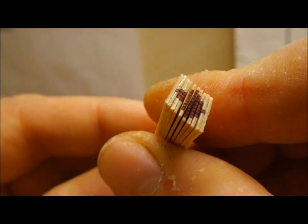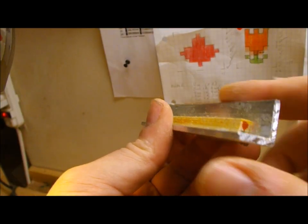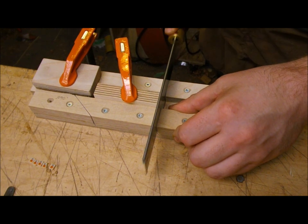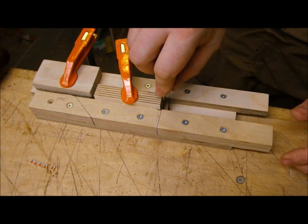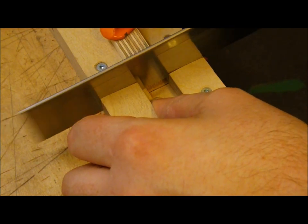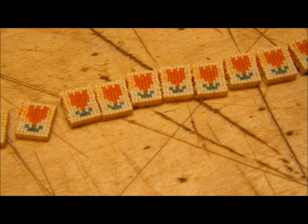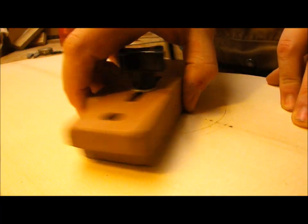When the rows are all scraped to thickness and in their correct orientation, they're ready to glue up. I use a little aluminum right-angle jig for that and leave the whole assembly in there for about an hour, at which point the glue has set up enough that a palette knife pops it right out. After drying for at least a day, I cut the tiles free using a right-angle sawing jig. The individual tiles are about two millimeters — just over a sixteenth of an inch — thick.